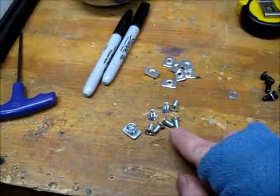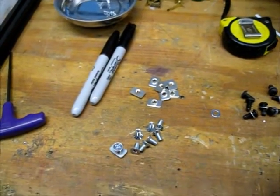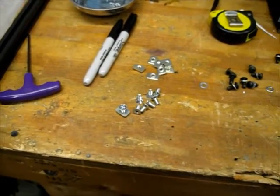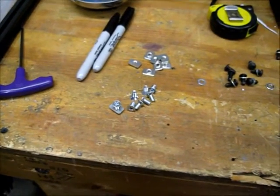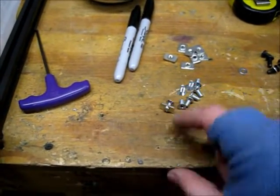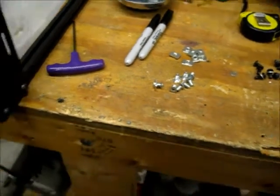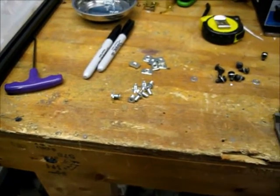I'm going to reuse the nuts and go to flat heads. That way I can countersink them down into the surface of the plate and end up with a perfectly flat surface, in case I have some sort of fixture plate that needs to ride over the top of those screws — I don't have to drill out little pockets for the screw heads. When assembled and fully threaded, I get about seven millimeters from the top of the head to the top of the flange when installed in the T-rail, so I should be just about perfect.